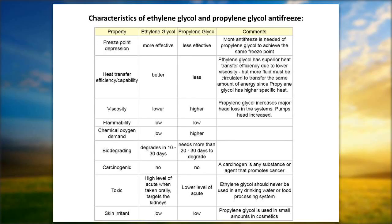Make sure that whatever you're using, it's good at the start of winter, if you're going to winterize your particular gauge, to maybe buy a couple gallons of the ethylene glycol antifreeze and mix it with your water. Keep a spare gallon handy, because if you do get a large amount of precipitation in your gauge, then you want to be able to change that out without having to make a trip to town or something like that. If you've got diluted antifreeze, then you lose the viscosity and the permeability to have a good antifreeze that's going to melt the precipitation as it occurs.